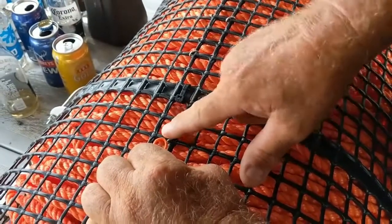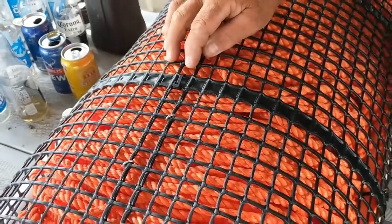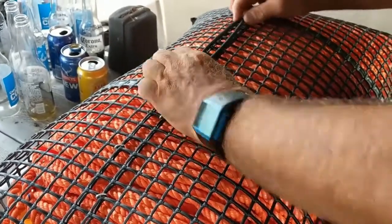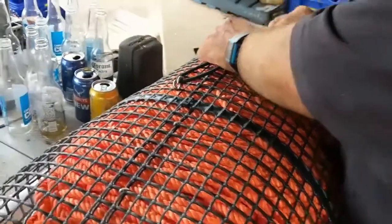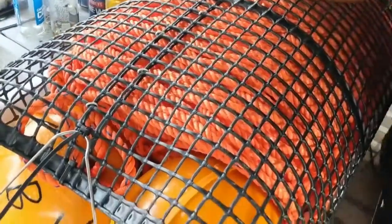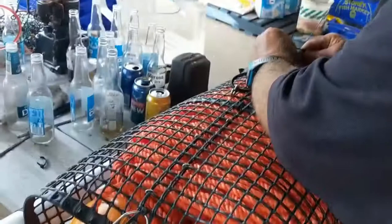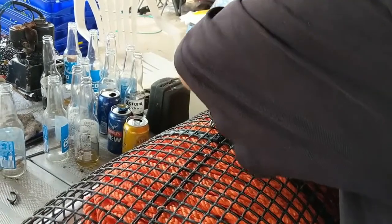We go at least three to four holes, and we need our bungee — a small bungee with a little hook. Locate it so you've got about four squares of tension in your bungee. You have to watch that your bag is well packed, because over time the bubbles might go further down and you'd lose tension on the line — and if there's no tension on the release cord it could take hours or days before it releases.